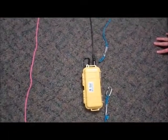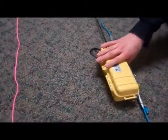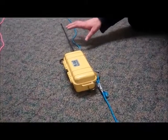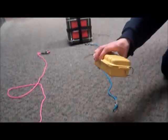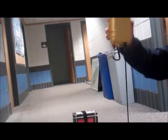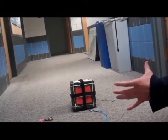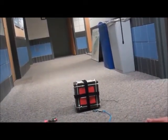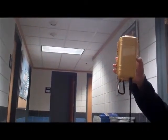The all-in-one microtrack you can get online for around $200 to $300. This one has a rubber duck antenna attached. When you set up your payload chain, you want to make sure that this antenna points down like this, toward the ground — toward the last package in your payload chain. It's because the antenna has a donut-shaped radiation pattern, and you're going to have a null in the center, so you won't get any reception there. You want to point it down straight to the ground so you cover as much area as you can.